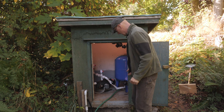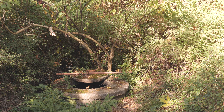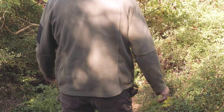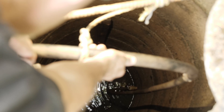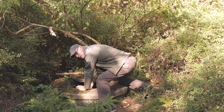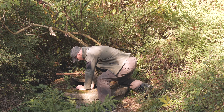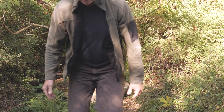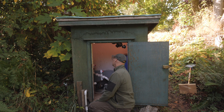I'm ready to test this. I will start the pump by running the water, and once the pump is running I'll go pull the intake hose out of the well. Hopefully I'll be able to pull it up far enough. I've got the hose up out of the well. And I just heard the pump click off — we'll go have a look. It says 'dry.' The pump has run dry and the relay turned it off.